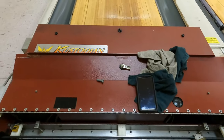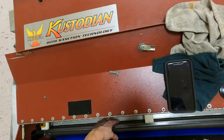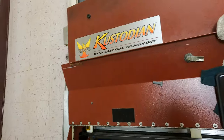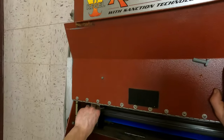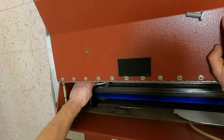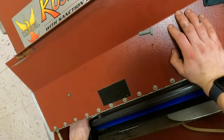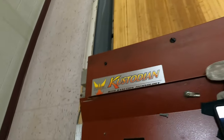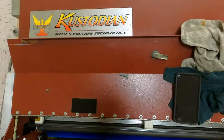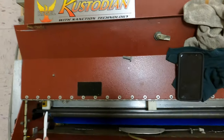Here's your oil roller right here, and then you have these smoothing pads that level it out. If you look here, you get all this dust and stuff that picks up off the lane. These ones aren't bad right now because I cleaned them a couple days ago, but you can see all that stuff in there, and that affects all the oil that goes out on the lane. So you want to try to keep these as clean as possible when you're running the machine.